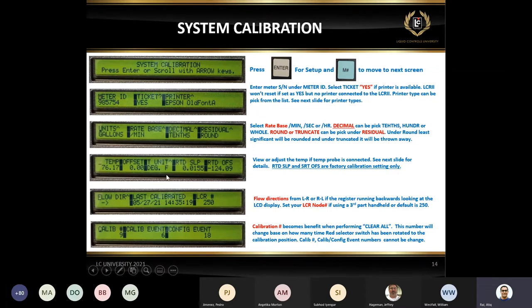So that's your temperature. Now, especially for the LPG market, if they're doing calibration and they put a calibrated probe next to the LC probe, and if there's a small difference, you can adjust it by so much, like a half a degree. But you cannot adjust it a degree or 2 degrees. We recommend that if you see there is an issue with your probe, that it is failing compared to the calibrated weights and measurement probe, you must replace the probe.